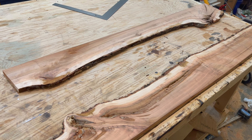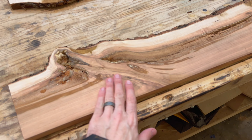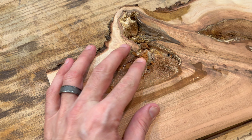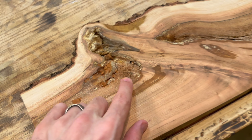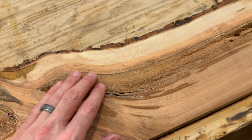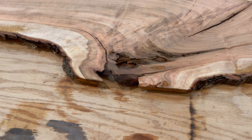Now that this has been run through a few times — once on the back and a couple times on the front — it really helps level it out and clean it up. There are a lot of imperfections in this wood that give us an opportunity to make some fun character. I'm going to dig out a lot of this with a screwdriver. There's also a big dead area where a branch was attached that I'll clean out as well, leaving a big open area, and then we'll sand it and take a torch to it.